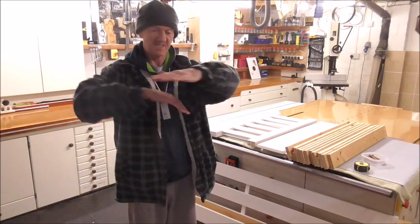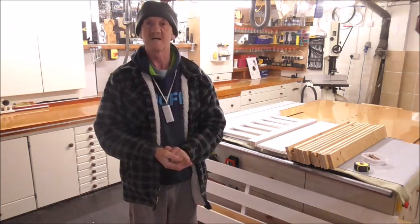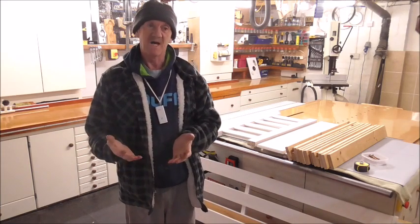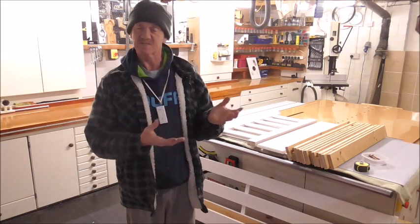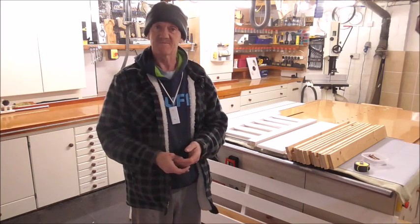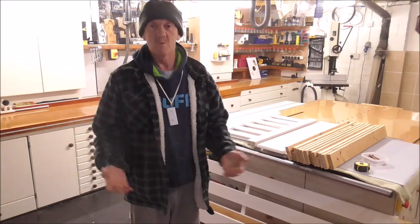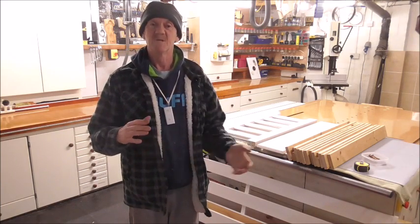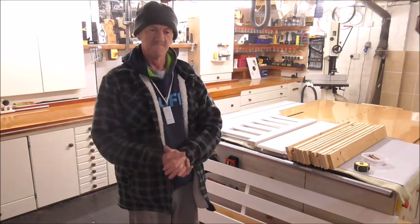It's not a high wardrobe, it's about this sort of height, so it's giving us approximately the right sort of height to work from. What I want to do to add to this, first, is adjust the bed because it's too big. I want to bring it down to the size of the standard mattresses that we're using, which are the 1900 by 750. Which will give us more space in the bedroom as well, because like always with these cases, space is a premium, so we want to get as much of it back as we can. So we'll reduce the size of the original bed, the framework.